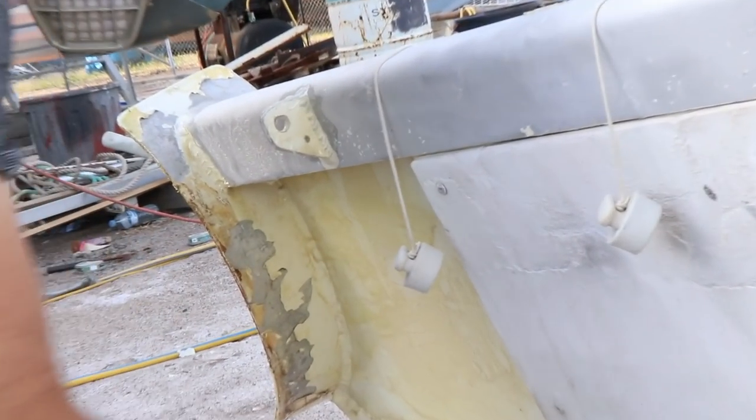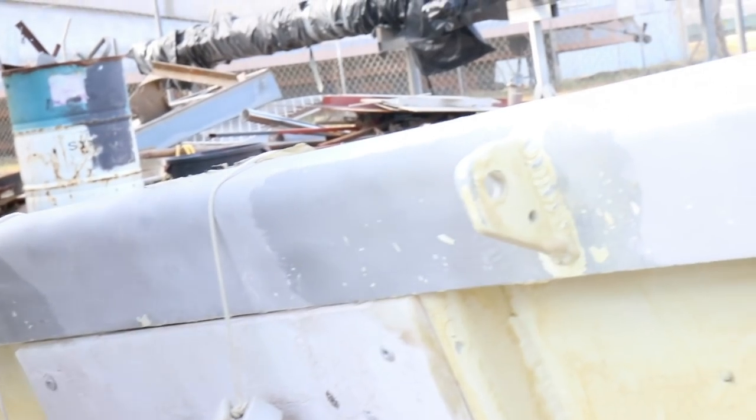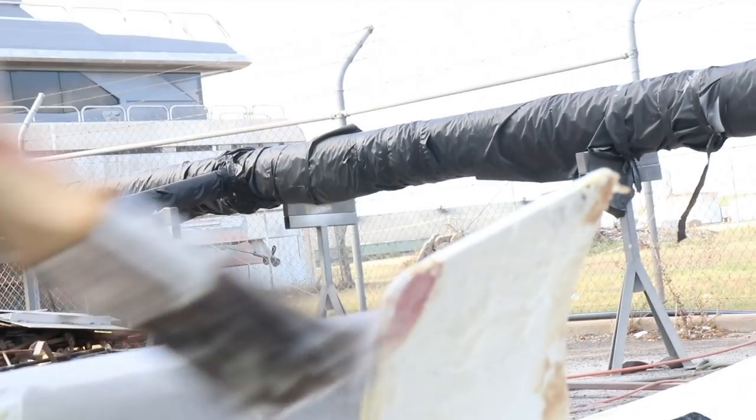If you're ever using paint stripper, pile it on. Don't be shy. It doesn't work if you put it on too thin. You have to do multiple coats then, whereas if you put it on a really thick coat, like quarter inch thick sometimes, it works brilliantly.